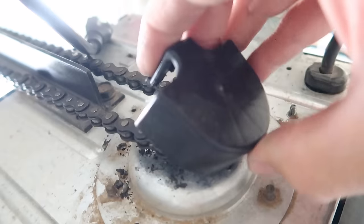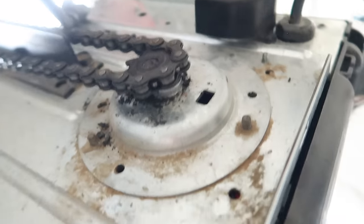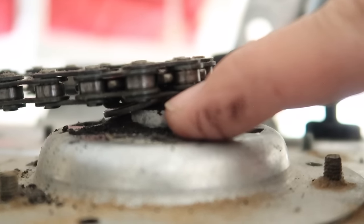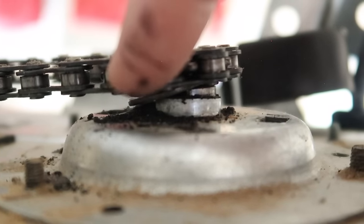If you come up here, under here, there is a gear. And if you look at it from the side, you can see how crooked it is — it's tilted like that. Also you can see parts coming out. This bushing is worn. You see this debris, this little black stuff there.